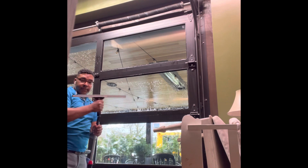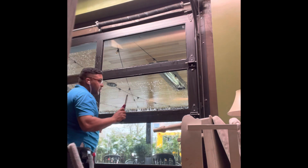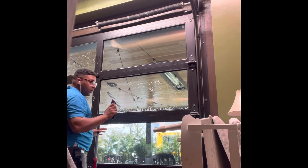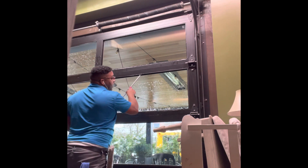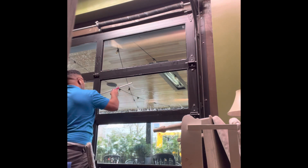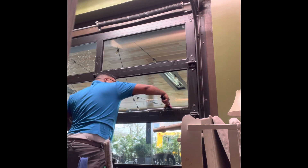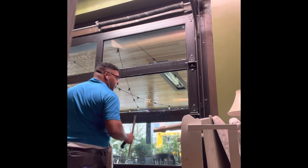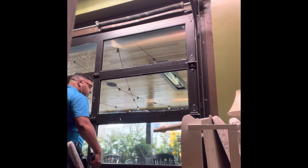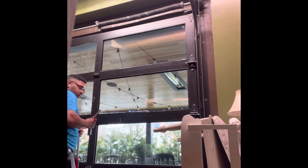When you're doing windows where you can't fit the squeegee in, here's the trick: come in toward the corner, go at an angle like that — one corner to the other — and then finish right to that other corner. Remember the rotation: pull the water away so it pulls it off the sill. Then if you're good about it, you can actually take your squeegee and wipe the sill.